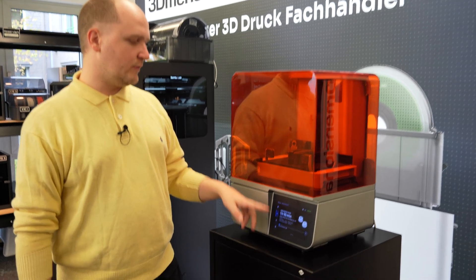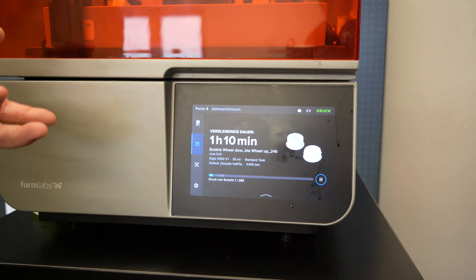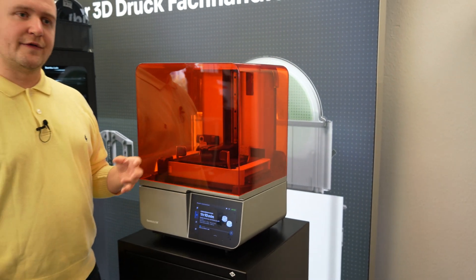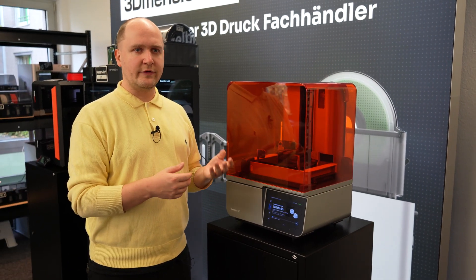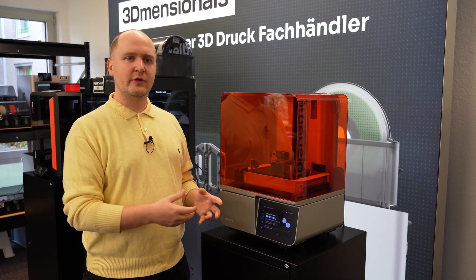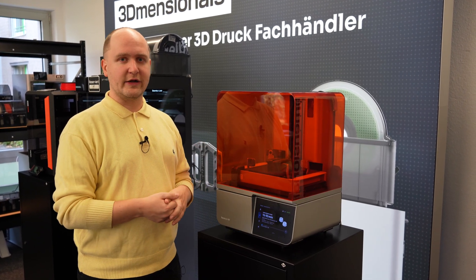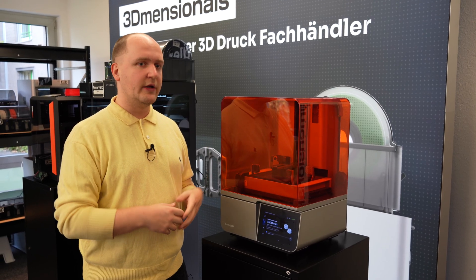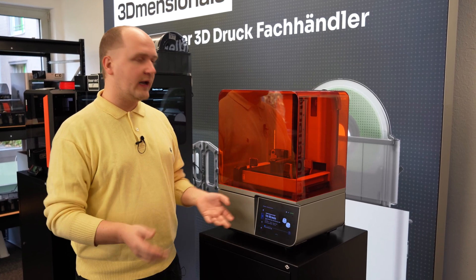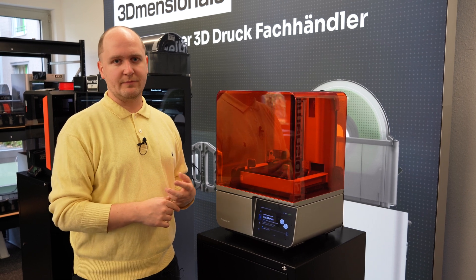Our tools should be ready in one hour and ten minutes. The material usage was about 100 milliliters, so with material costing 175 euros per liter, we have quite a cheap tool that we can access really quickly. If there's a custom job and you need a tool, I think within two hours we can reliably produce these tools for sheet metal forming.